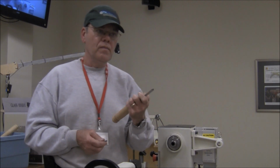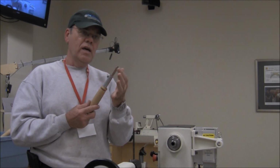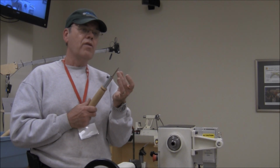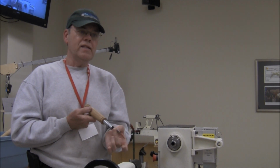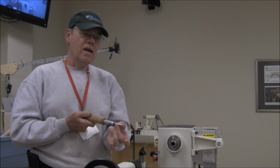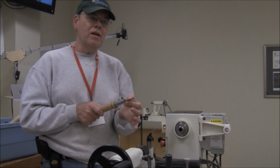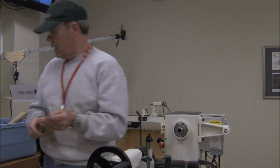So that's not the piece you bought? No, the difference is this is a 1/2 inch as opposed to the ones you get with most chatter tools, which are 3/8 of an inch. They are both 1/16 of an inch thick. So all I did was slide this out just a little bit, maybe another 1/4 of an inch more, so it'd vibrate. Can you pass that around?